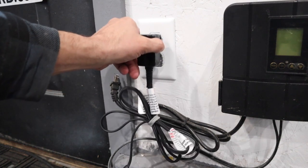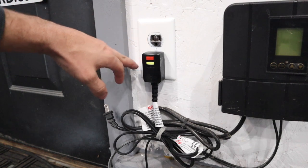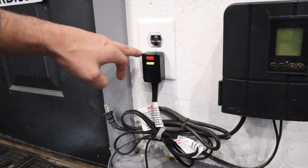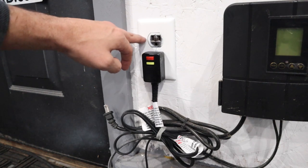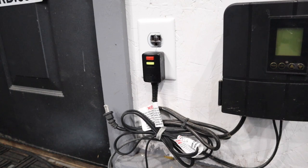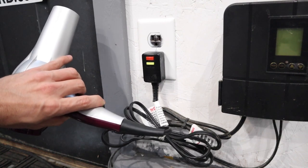Either way, test both outlets. This is one of those instances where you could have the top or bottom outlet on a switch, and the other one could be hot all the time. This can be a dual circuit right here — they can be separated by a little tang that you remove, and this outlet can be fed from either the top or the bottom, or it can only be on one circuit. So just be careful — always test both outlets.